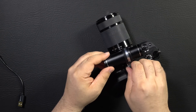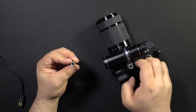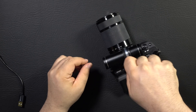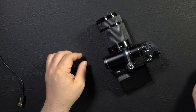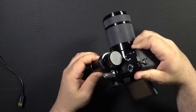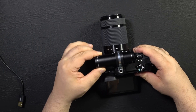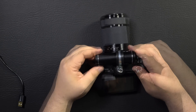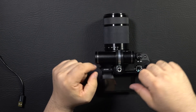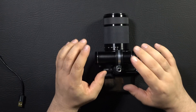One more thing — this nut can get hard to turn. So actually, if you have a quarter inch 20 connector — this is for connecting two bits of quarter inch 20 rod — that makes it much easier to turn. You don't need to turn this all the way down, you just have to make it so that it gets tight. One of the nice things about the rubber washer at the bottom is that even if you manage to turn this a bit, it's not going to break loose. A lot of times people use these adapters and have to crank them down, but if you give them a little turn, they just break loose and start spinning. The rubber washer really prevents that in this case.